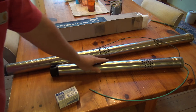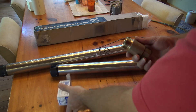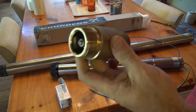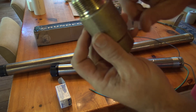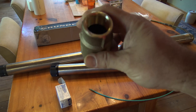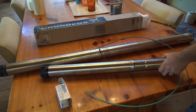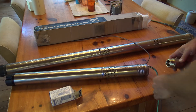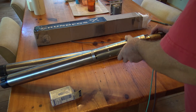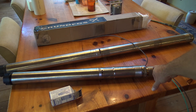It does have low water protection built in — if you run dry it will actually shut itself down. I do put some extra fail-safes in there. Even though most pumps come with an internal check valve, I like these Simmons SBA valves. These pumps all have inch-and-a-quarter NPT input/output. This valve will transition me back to one inch, because I really don't need inch-and-a-quarter and it's cumbersome in some situations. So I now have two check valves — it's already stepped down to one inch and away I go plumbing it to the house.